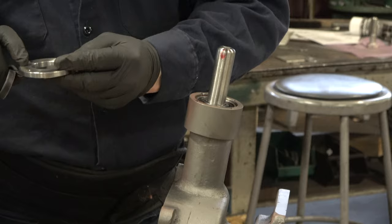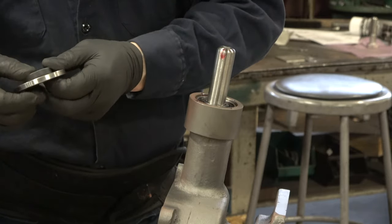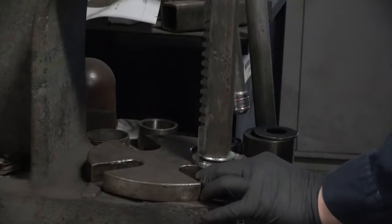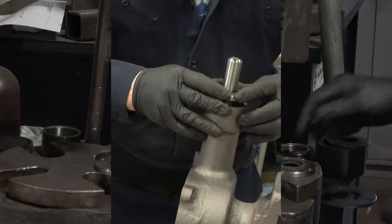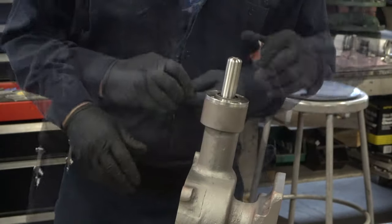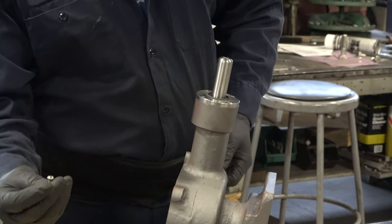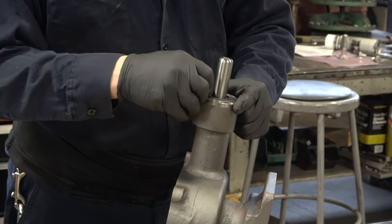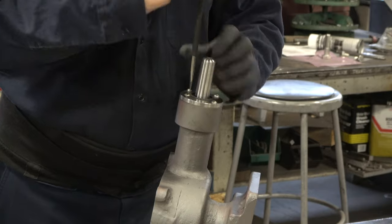At this point, we install the end cover. However, this end cover has a lip seal. As these are sealed bearings, you want the lip seal facing outwards to prevent dust or foreign material from getting into the bearing. We use an arbor press to locate the seal and push it into the end cover. We slide it over the shaft and then secure it to the gear housing with four screws — they're number 10 screws, 24 threads per inch, approximately 5/8 inch long. A flathead screwdriver can tighten these down sufficiently.